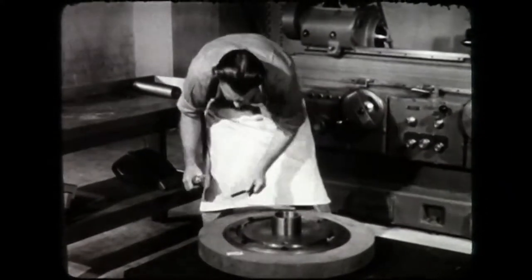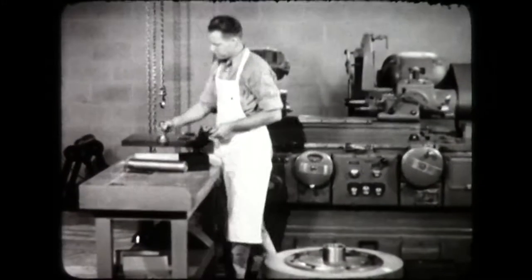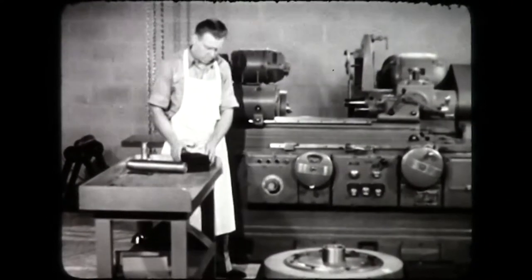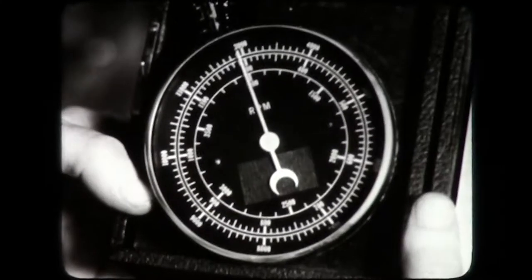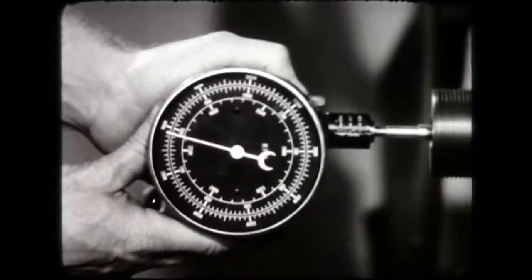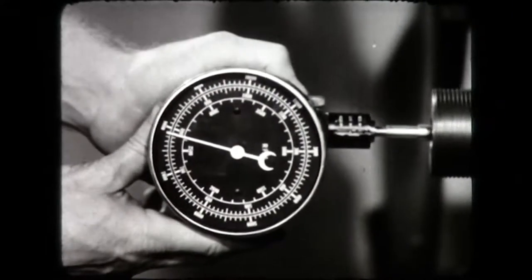Check the wheel speed rating. The maximum safe speed of this wheel is 800 revolutions per minute. Start the spindle and, as a safety precaution, check spindle speed with a tachometer. Apply the tachometer to the rotating spindle. An adequate margin of safety is assured by a reading of 790 RPM.